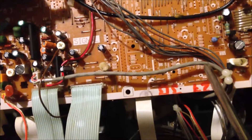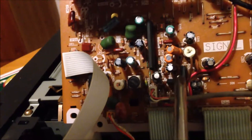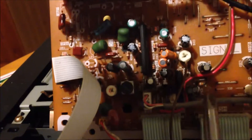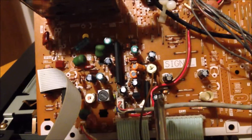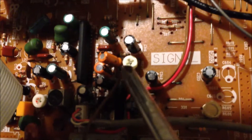You can see that the audio cable from the video head is plugged in here. We have an IC here, and another IC here — I think this is all about the audio signal. The variable resistor I mentioned is the white one, and this white one has three legs: two legs on the top and one leg at the bottom.